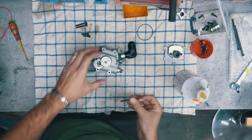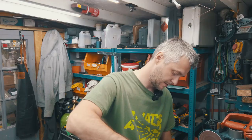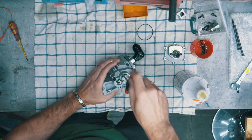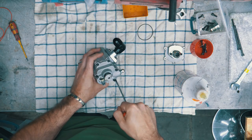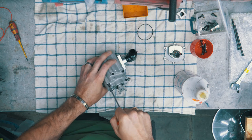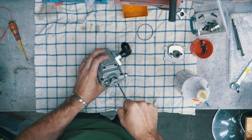So let's fit them. This one is the long one here. Unfortunately I have no idea what the correct torque is — there is no information whatsoever. We're doing it by feel, but because there is a rubber O-ring, from my experience you don't need to tighten it too hard, otherwise you'll just squash it too much.